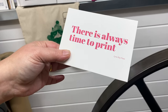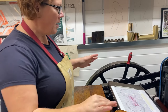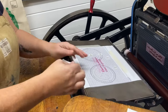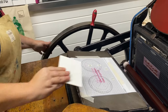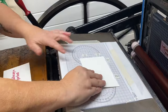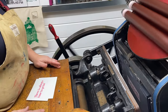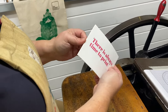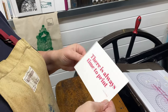I could probably do a little bit of make ready on the small type, but for now I'm happy. I know with a couple of minutes' work it would be close to perfect. Now everything's in position — what you can do, just to make sure nothing moves, is tape over this final corner. Very rarely will you have to move the tympan sheet once you've got it lined up with your design. And then we can go on and print, knowing that each and every time your design is going to be in the same place. They're all in the same position.